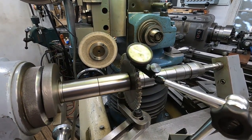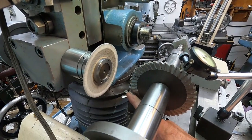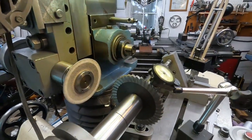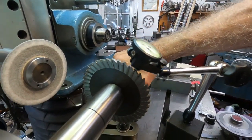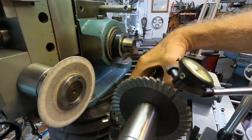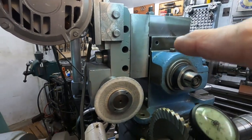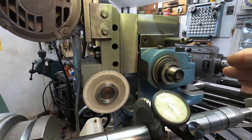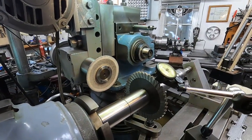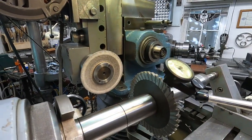This is the best setup I have for doing this type of cutter. I've got the spring-loaded finger here set up to catch the tooth on center, and I can rotate — I've got it locked so it clicks each tooth. Then you bring it back down onto that finger and lock it down and run the grinder across it. This is an older cutter grinder that does not have the tilt head, so I've got a tool post grinder hooked to it, and I can tilt it for the degrees I need to grind. Makes things fast and easy. I've got a dish wheel — a three-and-a-half inch dish wheel — and that's an ideal wheel for me.